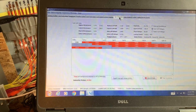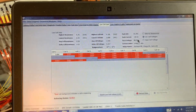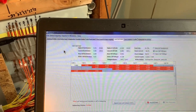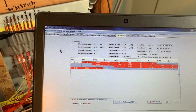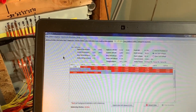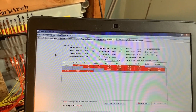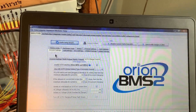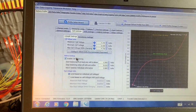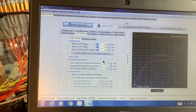You can see 40 amps here of DC charging — so it's about 4 kilowatts right now. I have a little bit of a problem with balance. Cell 1 is way out of balance with the other ones, and I think I'm actually approaching max charge here, which may be why some cells are going high. I enabled cell balancing under cell settings in the profile, and it's doing so — though when I did that, they went way out of balance, so I need to check that.